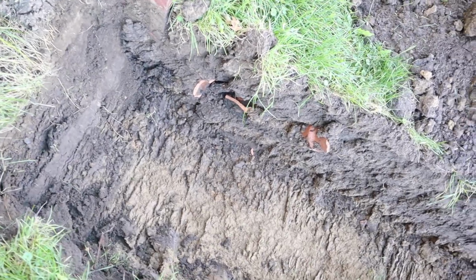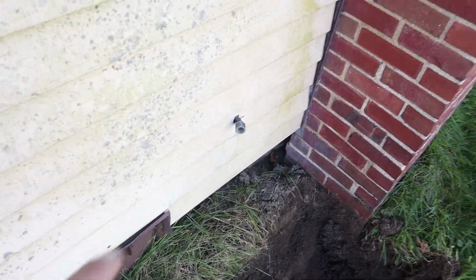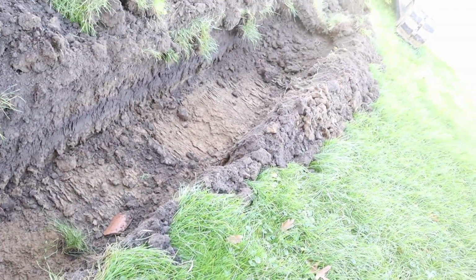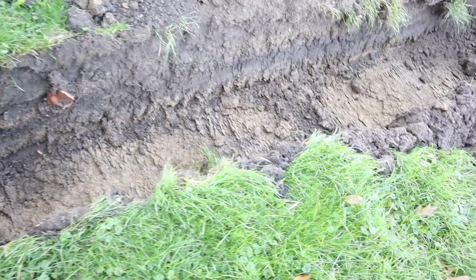Now, like every good digging operation, we obviously hit something. That is a drain tile to that downspout. Not a huge deal because they're plugged anyway, but that's the gas line we're trying to tie into. So we'll use a shovel for this part, but that's about 2 feet. I like it good and deep because what always seems to happen is they put these in 2-3 inches below the ground and people run into them.